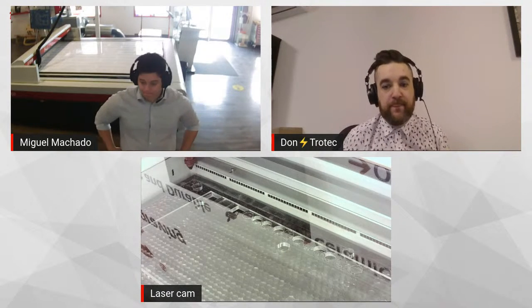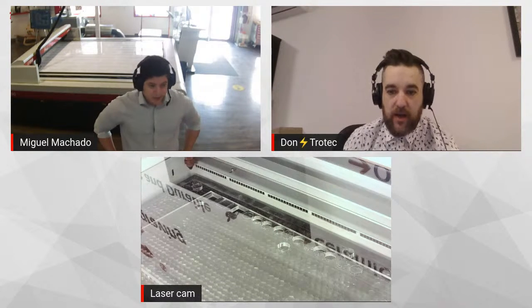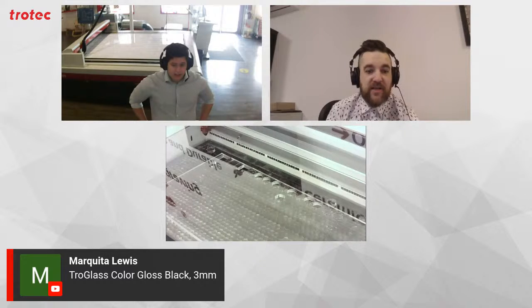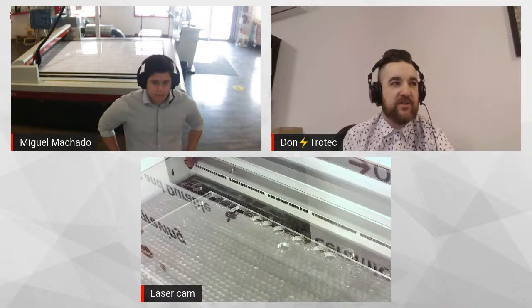Though we've tried a few things. We have some hacks on the YouTube channel. That would be something we'll have to tackle. With lamacoids, you have to be very specific with settings for it to not be as sticky as it can, and not to bow or bubble up. As far as the color gloss black, like Miguel said, I would double check that your air assist is working properly, provided that it is, I would also look at potentially adjusting your settings a little bit, using the matrix to test a lot of different settings and see if they stay.